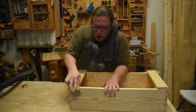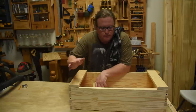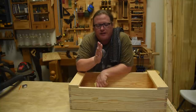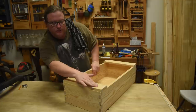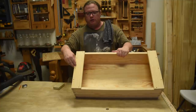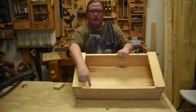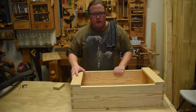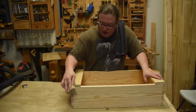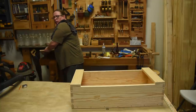Installing these was as simple as drilling holes at the same dimensions as down the side — that two-to-one ratio. The only really different thing I did was that because both boards are going in the same direction, I ran a slight bead of glue on one board. The other board is not glued in — it is screwed in — so if that moves, it's all going to be okay. Then it's just a little round-over and sanding, but really knock off these corners because they will catch you. From here, now we get to work on the top.